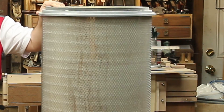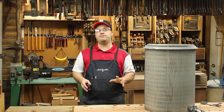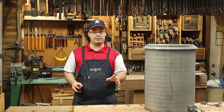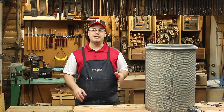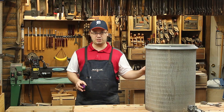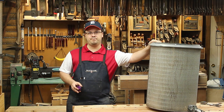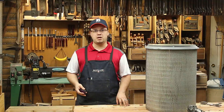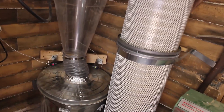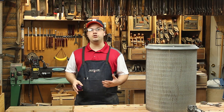This is a cartridge filter for a single-stage dust collector — like your Harbor Freight, Jet, or Grizzly collectors. It's a nano filter with a MERV 15 rating, collecting virtually 100% of anything larger than half a micron — that's 1,000% finer filtration than even the newer 5-micron filter bags. Since it's pleated, it has about 275 square feet of surface area, almost eight times as much as a bag filter. This one goes on top of the dust collector at the Mustache Mic shop. Here at the Stumpy Nubs Workshop, we use a cyclone, which is a bigger system, so we use a stack of three filters — MERV 15 with 300 square feet of surface area each for the top two filters.